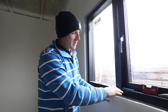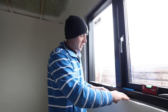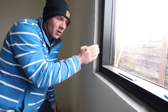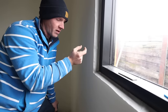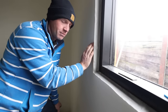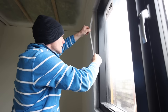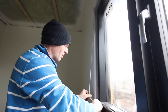It's great tape but it doesn't stick to wool clearly - or it does, but it doesn't create a good bond. Unless the wool is set back maybe 10mm it might work better. Where we set this tape on the frame it's a little bit wider than we need because a lot of the other rooms have a batten so the wall is a little bit deeper. I'm going to trim this bit off - one option was to fold it back onto the paintwork because I'm going to put an architrave-type trim around all of the window frames anyway, but I like the idea of keeping it trim and flush.